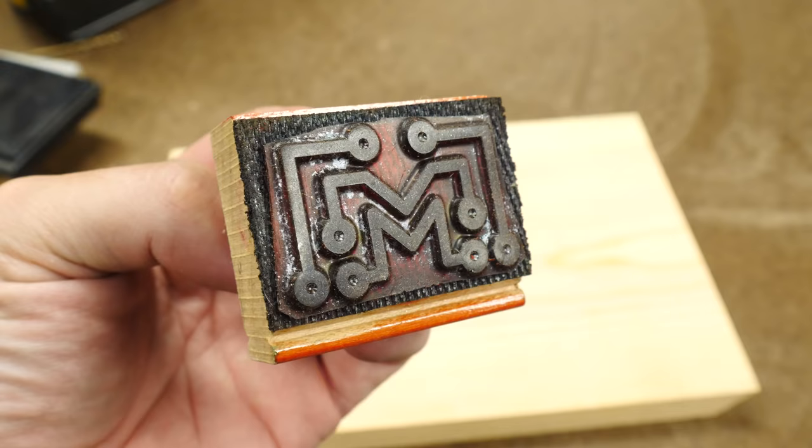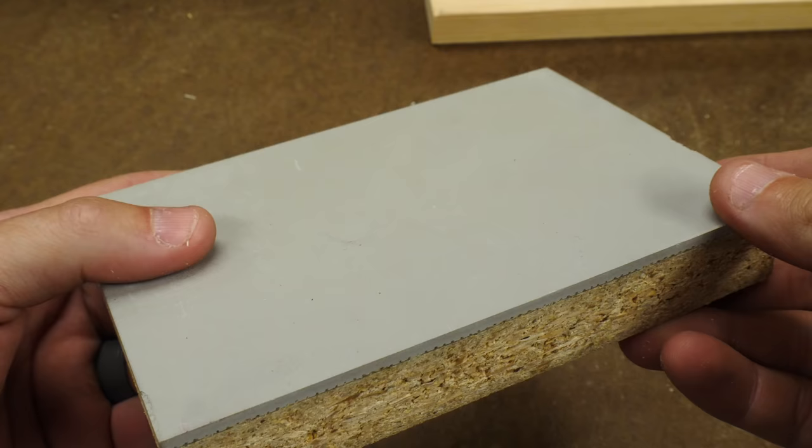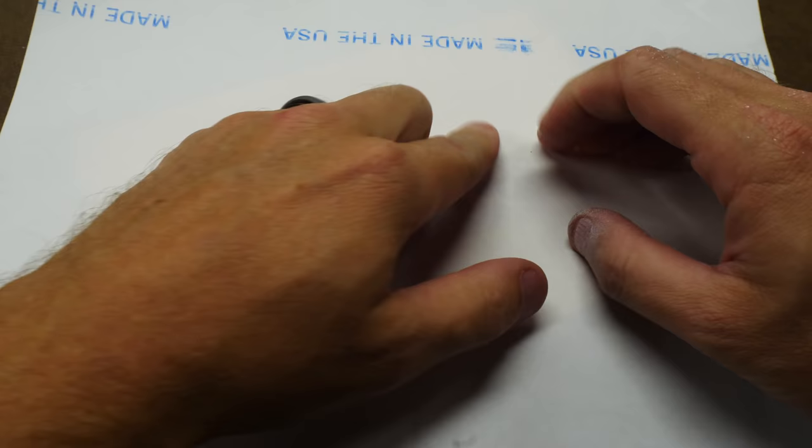The next one is ink transfer, and you can do this in a couple of different ways. You can make a stamp, have one made for you, or carve one out of simple stamp-making material. But if you've got an inkjet printer at home, there's a really cool way to add a full color image. Take a piece of label paper for your printer and peel off the label, leaving the glossy back. Run this through the printer and print your image backwards. Since it's glossy, the ink won't absorb — it stays right on top. Flip it over onto your workpiece and it will transfer all the ink. Make sure you have a steady hand and lay it down flat, otherwise it will smudge. Once it transfers the ink, peel the piece away and put some clear coat over it to keep it safe.